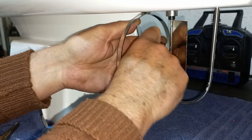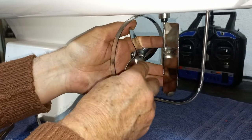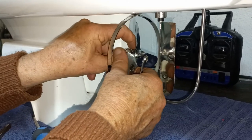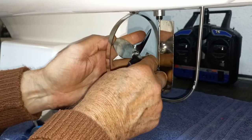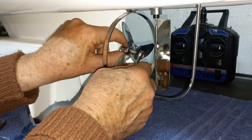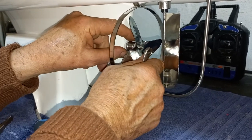There's only one way you can tighten this properly. You don't put a lock nut, you don't put a nylon nut — you simply use a plain nut but you lock it against the prop. Bring it all the way up and give it two tweaks, then check again for play. If it's tightened up against the washers, simply loosen it and turn it back a quarter turn, then try to lock it again. Importantly, there must be play on the washers — there mustn't be binding. The motor mustn't have to work to turn the prop just in the housing; it must work to turn the prop in the water to give you thrust.